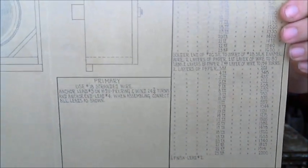This system has a complete 7,200 turns of wire in the bipolar secondary coils, making it one of the lowest frequency coils marketed. With these low frequencies, you're able to use a very large capacitor and get very high efficiencies from a relatively simple system. The primary coils called out for 24 and three-quarter turns of 18 gauge stranded wire in each coil — so it's a very, very low frequency when you take into account the 0.6 microfarad condenser with so many turns on the primary. It's probably operating at less than 50 kilohertz.